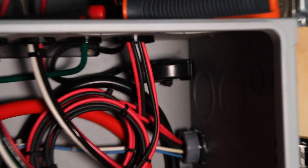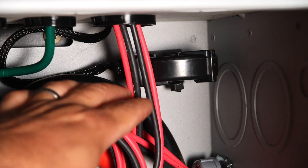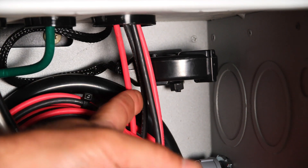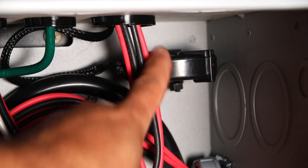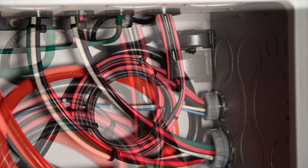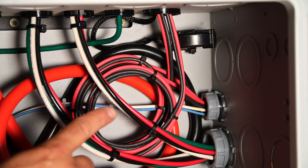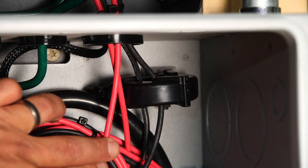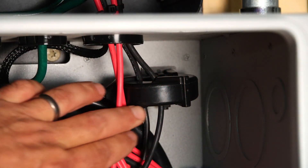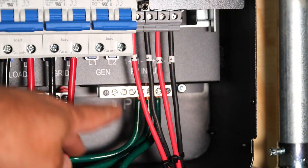Looking inside the wiring trough, back in this corner is the transmitter core. Now I just need to disconnect my negative solar panel wires, run them through the center of that core, and then back up to the inverter. I've got an extra loop in the solar panel wiring, so there's plenty of wire to reroute. Both negative wires are now going through the center of the core and land on the PV inputs just like normal.